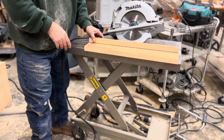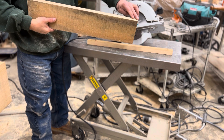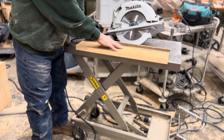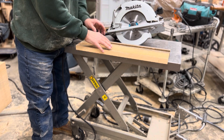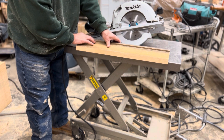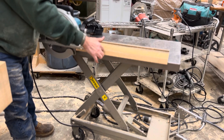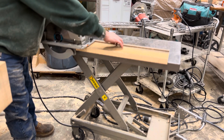I've already made this one, but I'm going to walk through what to do. Take a piece of wood that you want to be your offset, take one side and run this side here through your table saw so you've got a nice straight edge. Take another piece — it's got to stand proud of your offset piece so that your table fence on your saw will run against it. Connect this up with some screws, and now what you have is a piece of wood. This fence, of course, is against your table saw cut, so we know that's straight.